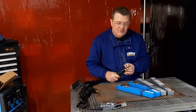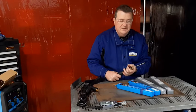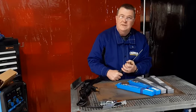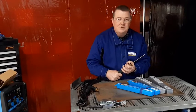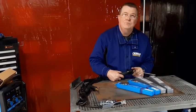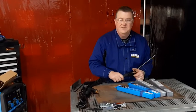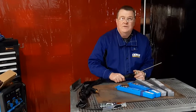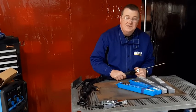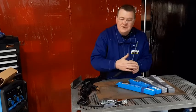From iron powder electrodes you step up into low hydrogen electrodes, also called hydrogen controlled electrodes, which are a higher strength electrode. If you're welding something like a dozer bucket or plant and machinery requiring high strength, you normally go to low hydrogen electrodes. There are two main types: the 16 series, more designed for specialised pipe welding and structural steel, and the 18 series, which has a small amount of iron powder in the coating to allow longer welds.